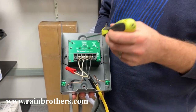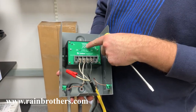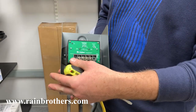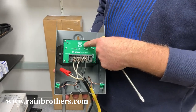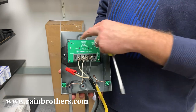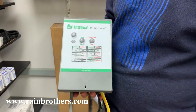When you're done with calibration mode, you're going to simply turn this set screw to a duration. We recommend right around 120 to 160 — that is how many minutes this Pump Saver will keep the well pump off after the well has run dry before it starts the cycle again. 120 to 160 minutes is a good amount of time to wait before the well pump starts pumping again. After that, you're going to replace the panel and put the screw in and you're good to go.